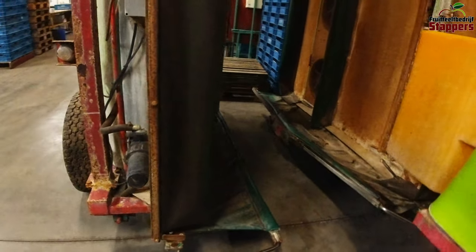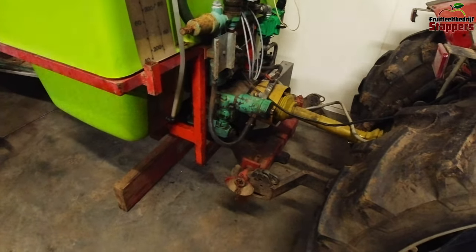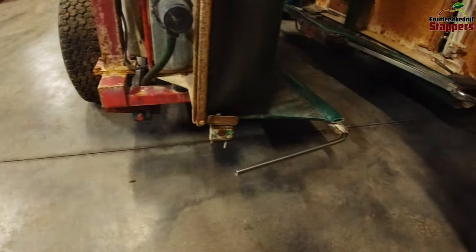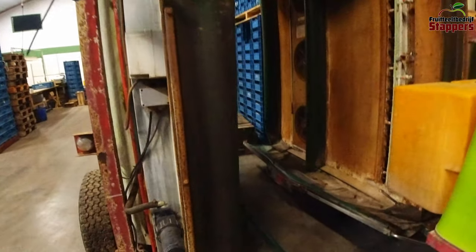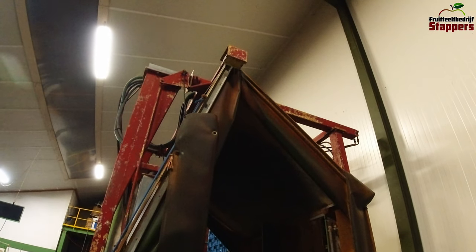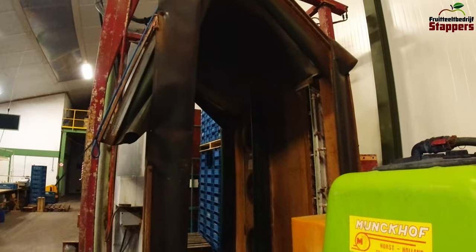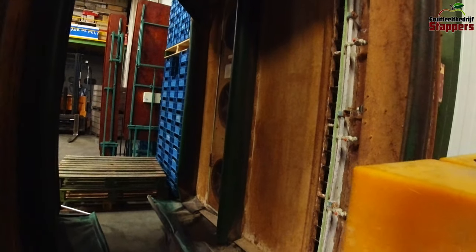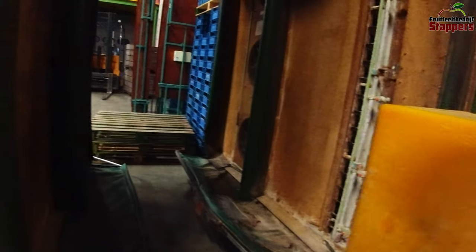From here it will be sucked up again and back into the tank. The machine is currently folded in, and that's why this part is up — if I fold it out, it will go down just like on this side. The thing is it should not be down at this side right now, but a cylinder is leaking and causing it to extend a bit, which is why this side dropped. On the front we have the tank connected to the hitch, so it's partly hanging on the tractor and partly on the sprayer. The sprayer can fold out and the tunnel can also be extended to become a lot wider for really wide trees. We have small trees, so we will probably just fold it out and that should be all.